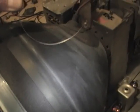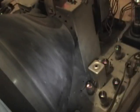See down there? There's a metal tab sticking out. There's one on the other side as well. And between those two, there's supposed to be a metal hoop like this I pulled out of another set. So that hooks through those two loops on the chassis and then brushes up tightly against this to ground it. And the whole thing forms a giant filter cap for the high voltage. So I definitely got to pull this out and get a ground down in there.